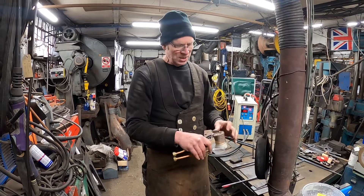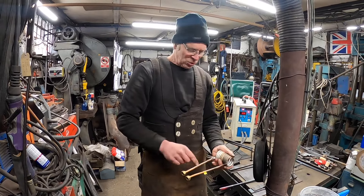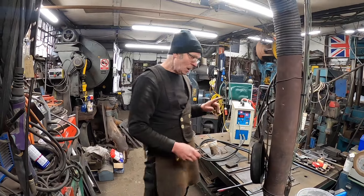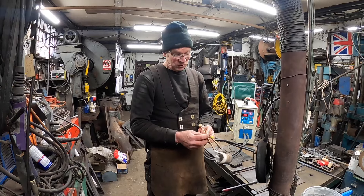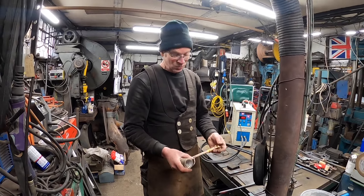Don't step them down — this coil looks like it'll take 30mm rod but it isn't; it's like 12mm. You need a big air gap or all the heat transfers into this little pipe and the water cooling can't go around fast enough because you're restricting the flow. A lot of people get the same issue when they put joiners in and restrict the size — it puts the flow down and the coils can't be cooled, so the machine doesn't work properly.